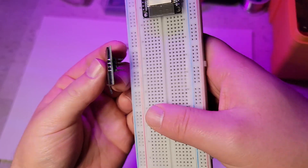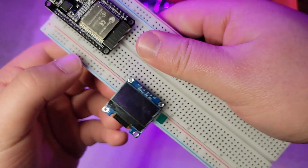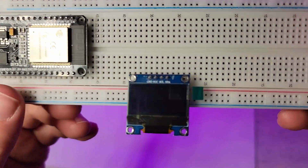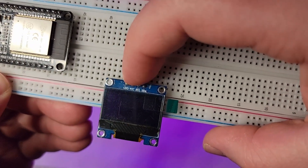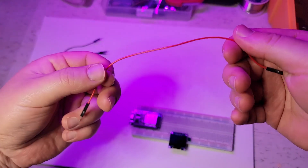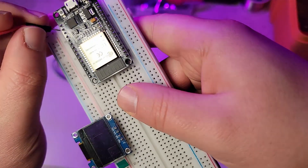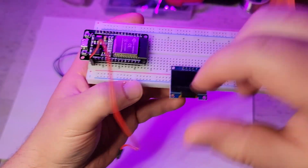First, I'm just going to slot this in, let's say, 35 to 31. It's right up in the breadboard. We have four pins: the ground, power, the clock, and the data. So let's just get the circuit set up. We got the red — we're going to do the constant 3.3 volts, that's 3v3. So it's just going to supply constant power into the VCC.